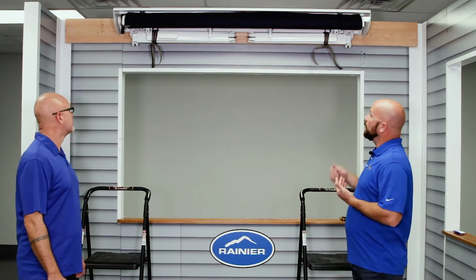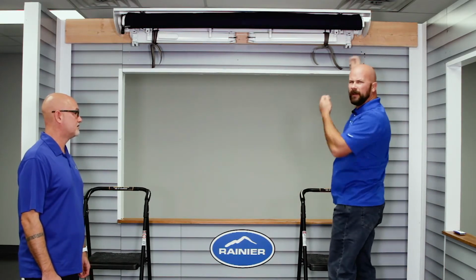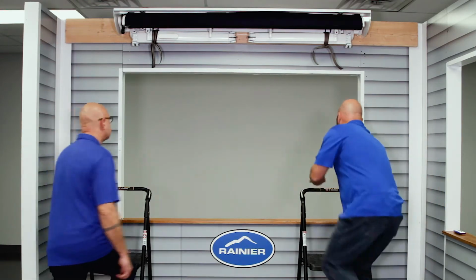If you have one of our optional hoods, the next thing you're going to want to do is remove that. It'll make it easier to get the fabric in and out. The other option is you could remove this wing here and slide it out. If it's a big awning with a big wide hood that's hard to remove, it might be your better option to remove the wing. But in our case, with a small hood, we're going to remove that. So we'll get that off of there.